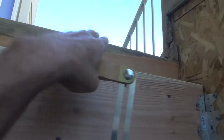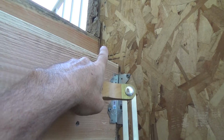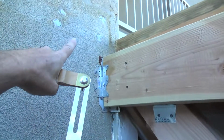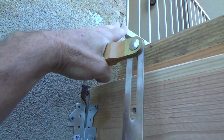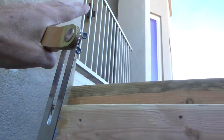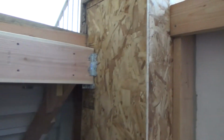I don't really want it to go right in here and go out of my step, and chances are it's not going to do that anyways because the water's going downhill. So in fact, I might want to cheat this a little bit and have that up just a little bit, and I might want to have this side up just slightly. You follow me? So that when the water's here, it's going to come this way, and then it's going to swale down and go out at the front here. You see what I'm saying?